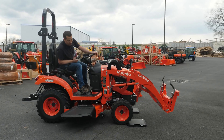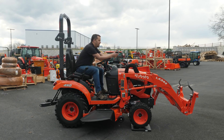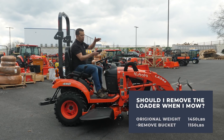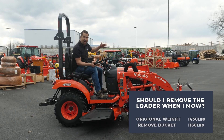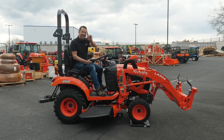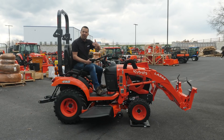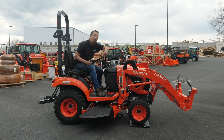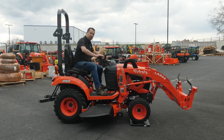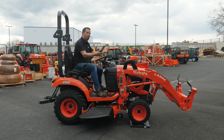Without the bucket on, we're going to pull back up onto the scales and see the impact of removing it. We were at 1,450 pounds before. Now sitting on top of the scales, I'm reading right about 1,150 pounds. By removing that bucket, we've removed 300 pounds from on top of the tires. The interesting thing is that bucket doesn't weigh 300 pounds — it's about 150. You see the implication: the load sitting way out beyond the front tires pulls the weight of that tractor forward and has a greater impact on the weight sitting on those tires than the weight of the bucket itself.